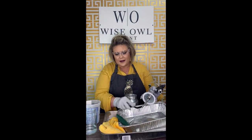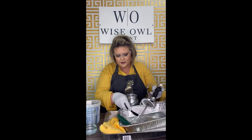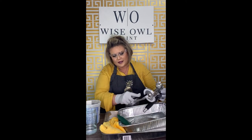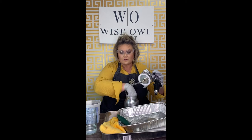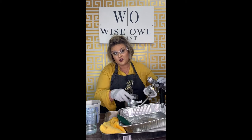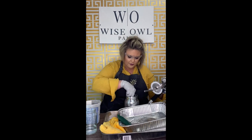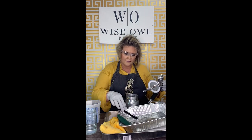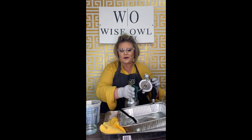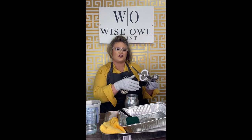You might wanna go ahead and dip into the acetone that's in your pressure cup and scrub off as much as you can on the outside of your paint intake tube or straw, as I like to refer to it. Comes off pretty well with acetone. You don't really ever want to use steel wool, brass, so you don't etch the aluminum.